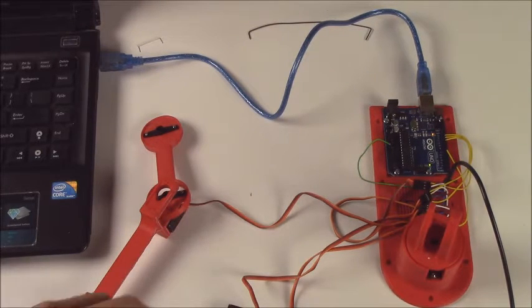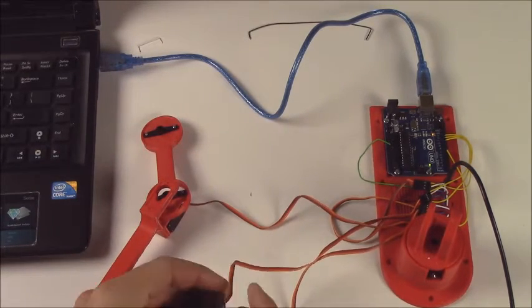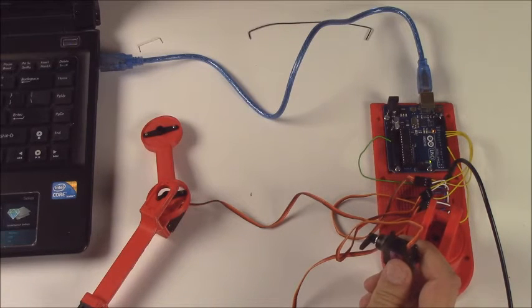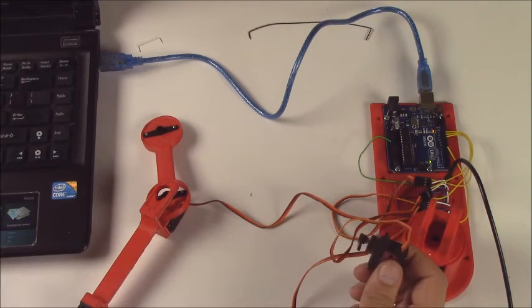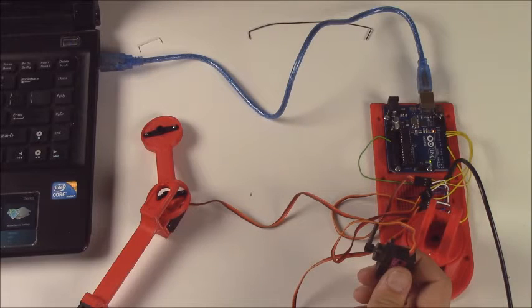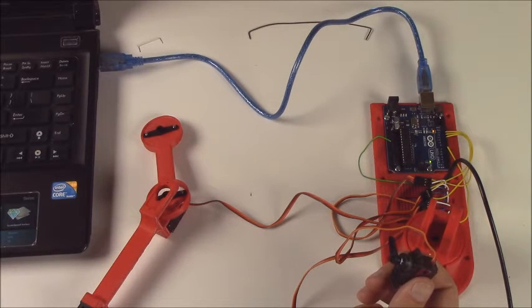Alright, now get your next servo, the shoulder servo, and maybe put a horn on it so you can see how it moves. You don't have to do this. I'm doing it for the video for effect. But move the servo back and forth. So that position right there is basically all the way down. You can imagine the horn basically as the upper arm of the arm. So when the servo comes up, it lifts the arm, coming down, lowers the arm right there.